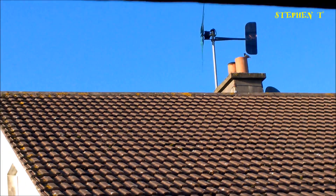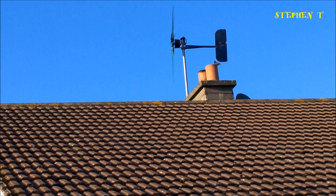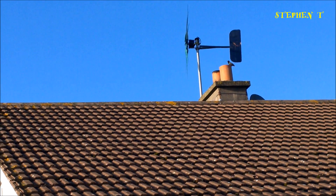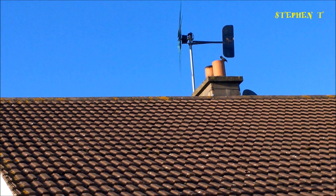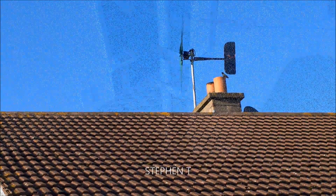I'm going to release it again — that's the shadows on the pole. Everyone that has a turbine that is three-phase should have an electronic brake hardwired into the cables. I'll put a video up to show you how to do that.